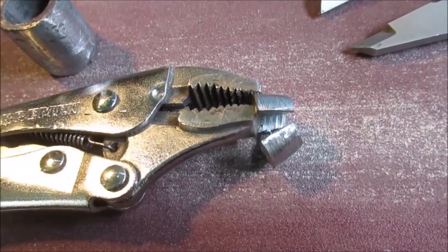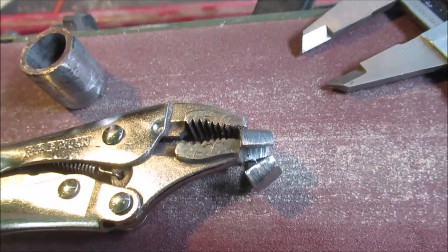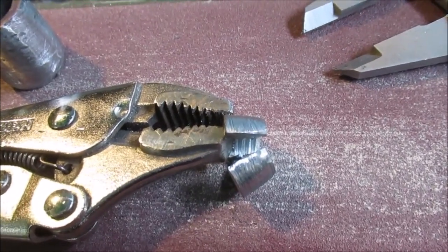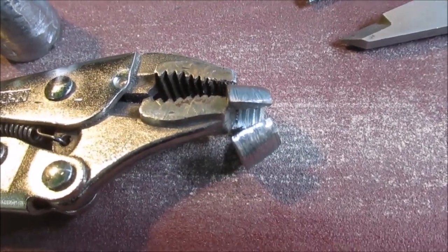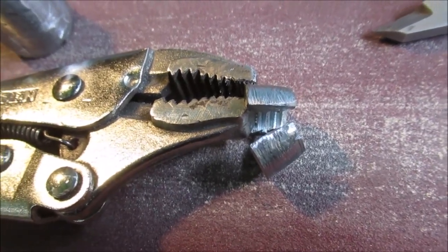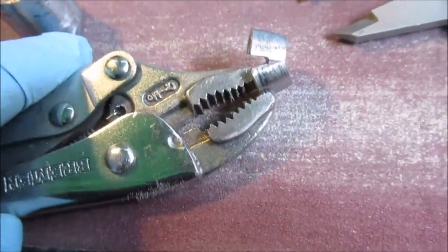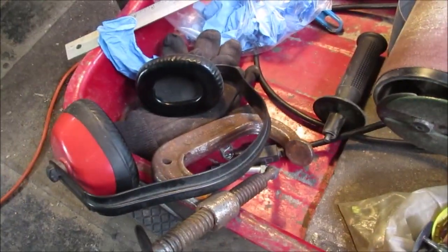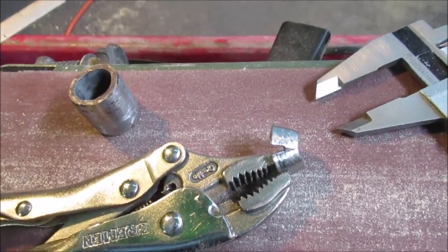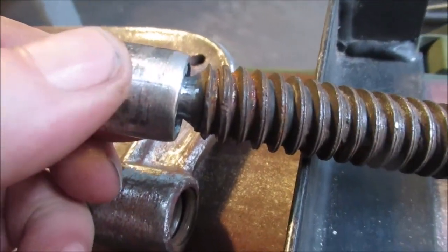If it's a bigger nut, or if it's the same size, put a flat washer on there and use that as a backstop. Back to work - I left that little bit so it doesn't fly apart or fly across the room. You can almost break that then grind it, plus it's hot. You'll be tempted to pick it up but I'm just wearing gloves to keep my hands clean. Great tip - lay it on a barrel when you're cutting, leave like four spots when you're done so you keep rolling across and cutting. I use this when making my wood stove - leave like four spots, a quarter inch of metal so it holds together. No binding, no pinching, no flying pieces hitting you in the face. I got safety gear.